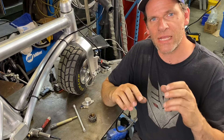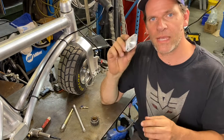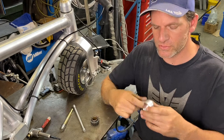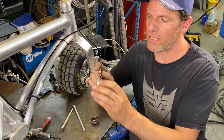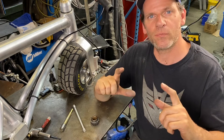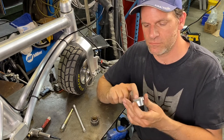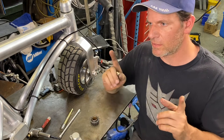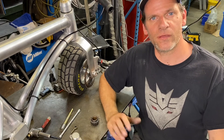What I'm going to do is drill a hole and tap it, then use this little bearing housing I had — it has two M6 holes. I'm going to put a bearing inside there; it's going to be held into the front, that top sprocket. Then I'm going to use these tie rod ends, which will give me some adjustability to straighten out the drill or put a little more tension on the chain. So I'm going to machine that up and machine up some tie rod bars, and we'll see if it still flexes like it did without the tie rod ends.